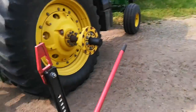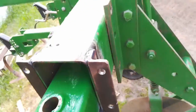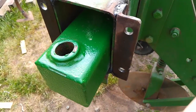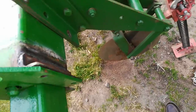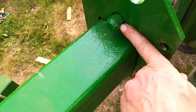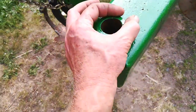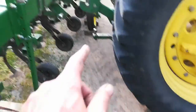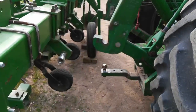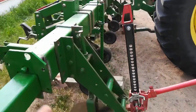This piece was on the end here — four holes bolted to these two angle irons that I rolled them on. This pin sits like this to prevent this thing from coming out, and there's a through pin through there, and a pin that comes up through this hole. It's pinned off, and then the two sides come here and they're picked up by the bottom of the three-point hitch. So I can pull it down the road that way, and it's only eight feet wide as opposed to fifteen and a half feet wide.